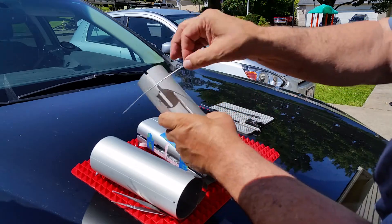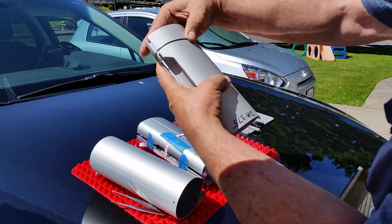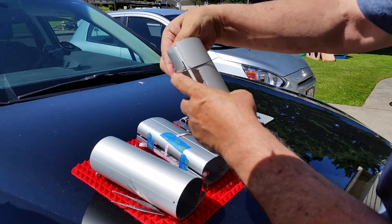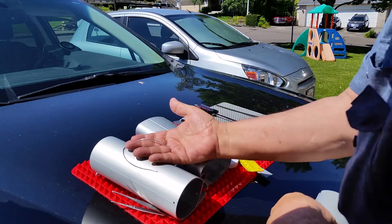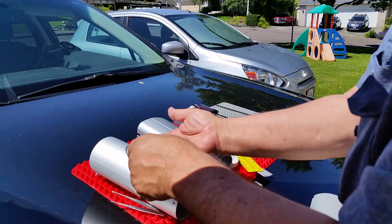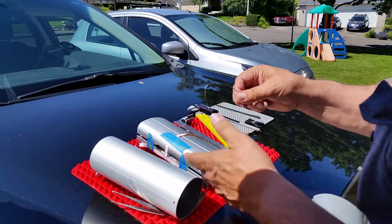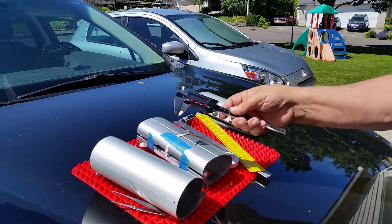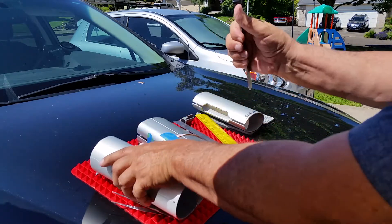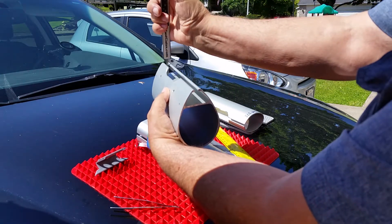Sometimes I may need to know the radius around your mast. You can use a solder wire to bend across it, then lay the solder wire on a grid paper, take a photograph straight down on the grid paper, and then I can take the measurements from the grid paper to duplicate your radius.